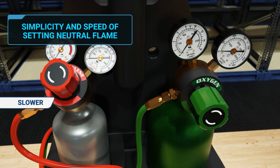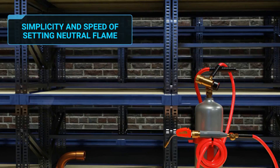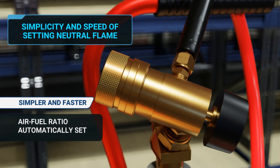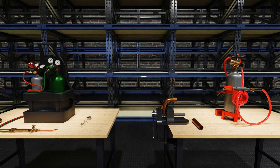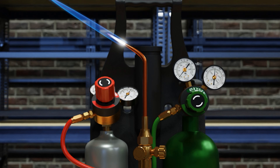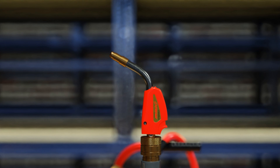Setting up an oxygen acetylene torch rig requires a bit more complexity than air acetylene. That's because the fuel to oxygen ratio has to be manually set on an oxygen acetylene rig, but is automatically set with the air drawn into the torch and mixed with the acetylene gas in an air acetylene rig. Oxyacetylene requires using a striker and controlling the flow of oxygen and acetylene at the torch handle as well as at the regulators. An air acetylene rig has only a single handle and in many cases uses a push-button spark light at the handle, as shown in this video with this turbo torch tip.